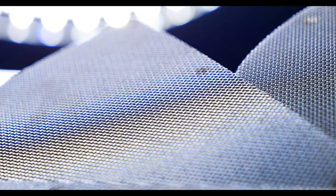A common focus that most plastic extrusion manufacturers share is the prevention of product failure. There are several circumstances that can cause product failure; however, contaminants in the plastic are the most common. When the plastic extrusion manufacturer begins production, raw or recycled material is melted down to be filtered. To accelerate melt flow, the melt is subjected to tremendous pressure when passing through the medium that holds several extruder screens, like the extruder breaker plate. As the melted plastic passes through the screen, any contaminants that may cause product failure are removed, and the filtered plastic is passed along to the rest of the production process. I should note, some plastic extrusion manufacturers implement a gear pump following their filtration screen to achieve consistent throughput. However, these gear pumps are sensitive to the impurities found in plastics. If your plastic extrusion process includes one of these, it's important to use finer mesh specifications for the proper amount of decontamination.